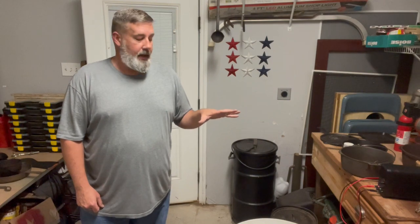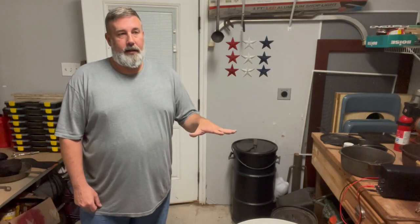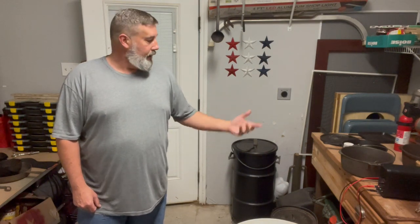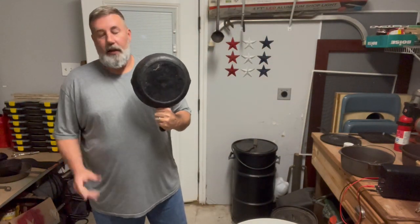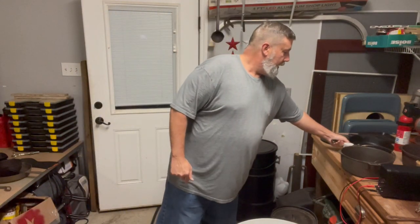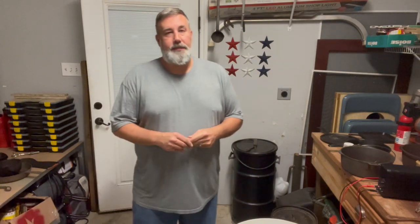One thing that you're going to learn is if you use an electrolysis tank, you'll get foam on top of it that looks white, it looks like rust. If you're cleaning a piece of cast iron, like a pan that has a bunch of seasoning on it, like this one has a ton, the seasoning will actually come off and make it look black. But what you see in all those little bubbles is hydrogen.